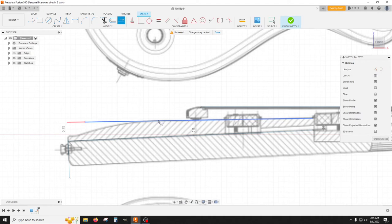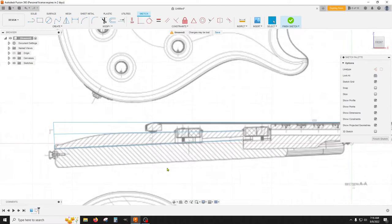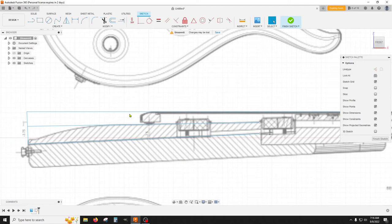So we take a look at those angles. I'm just going to extend these lines out so we can tie them all together. You can see on this PRS model if we do a dimension on here it's about one degree — in reality it's 1.1 degrees for a PRS — but then if we dimension from this line to this line you can see it's 2.5 degrees, so there's an additional 1.5 degrees between these two.